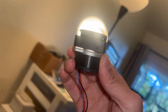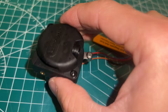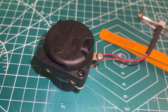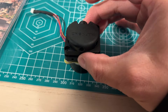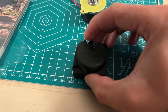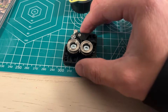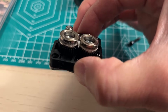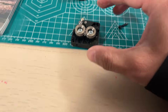And if you cannot get it out, then the unfortunate next step will be to take the two screws out and disassemble this module. So after removing those two screws, you can easily take the top section off this motor and then remove the cap off the extruder assembly. And look at this — there's a little piece of filament that got stuck there. And that's probably the reason why.